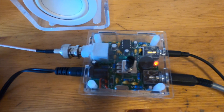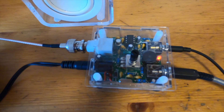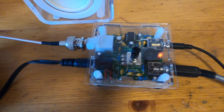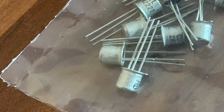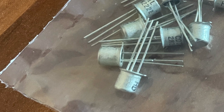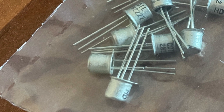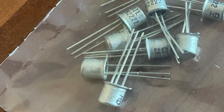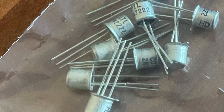After connecting the Pixie to 13.8V, the PA blew up again. You can see here it is a half-bright LED, and if you key it down it will be full bright. So the PA transistor died again and I have to replace it. I will keep in mind to operate the Pixie transceiver only below 12V and try to have a good SWR.